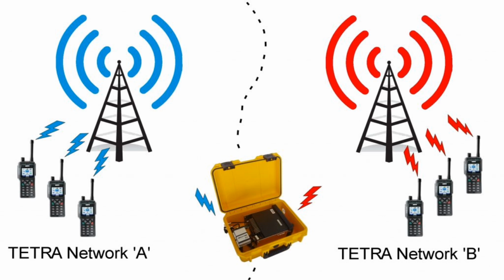And for GPS, like we touched on, it needs that clear sky view. It needs to track at least 4 satellites for its initial fix. Usually takes under 5 minutes, the manual says, but could take up to 30 sometimes. It even gives tips for avoiding GPS interference, moving the antenna, using a shield. Surprisingly, it mentions even cardboard and foil might work in some cases. Cardboard and foil. Wow. That's pragmatic, I guess.